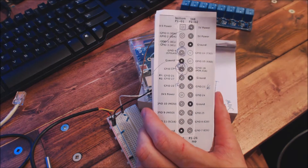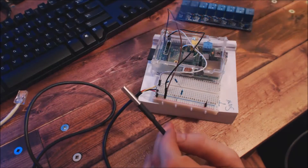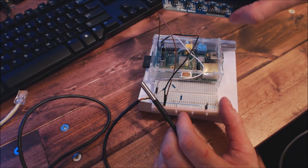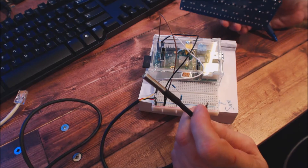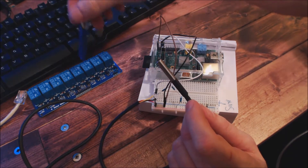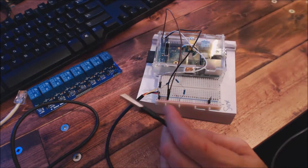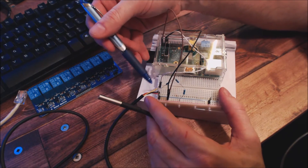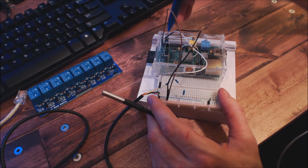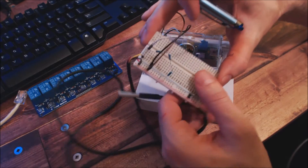Let's get onto the wiring. This is your temperature sensor wired up to your Raspberry Pi — it has nothing to do with the relay. If you ran power through it, you'd probably burn the temperature sensor up. But the way I saw you had it wired couldn't cause any harm at all, so don't worry about that. The signal wire is what actually gets plugged into GPIO4, pin number seven.